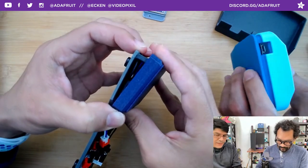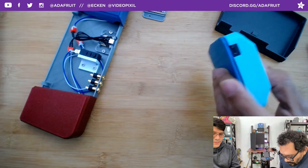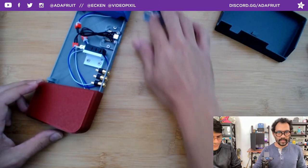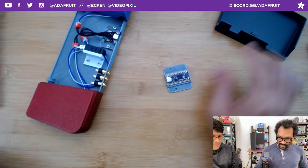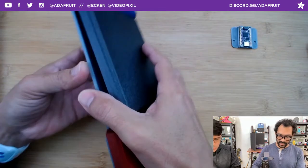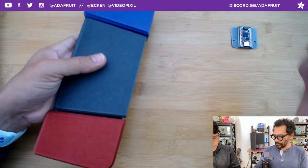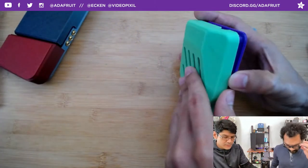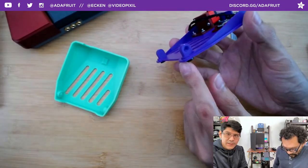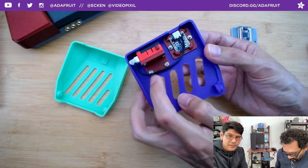One thing to accommodate when making these is that the USB port needs a really big cutout — when you push the lid down you have to have enough room for the USB port. This is the Trinket version; the QT Py uses USB-C which is great. The single-button version has been updated — it's still compatible with the Trinket but now supports the QT Py as well. You've got hinges with dimples that print without any supports, same bracket for the Zippy switch, mounted horizontally.